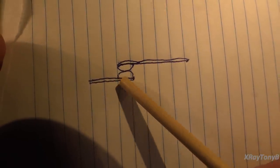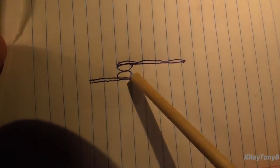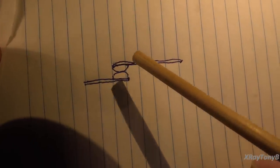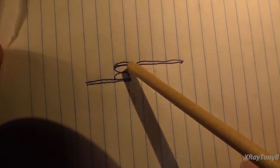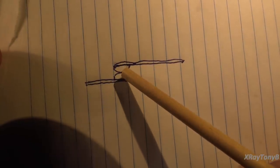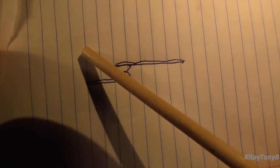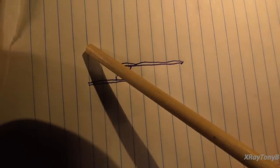So the first thing I want to talk about is my poor ability of drawing. This is just a drawing of a pair of contacts that you would see in a normal relay. If you look closely at the contacts, these are always made of copper or brass or some sort of conductive material. The contacts themselves are a hardened kind of metal, and they usually have some sort of plating. That plating is always made out of some special conductive alloy. But the plating also is designed to resist tarnish and to resist the heat of arcing and so forth.